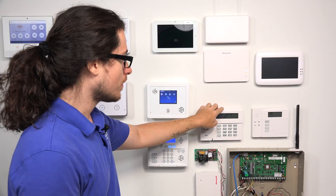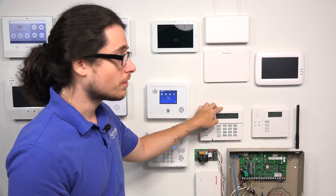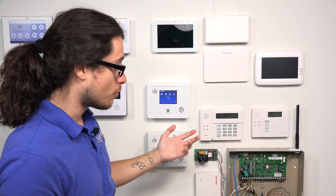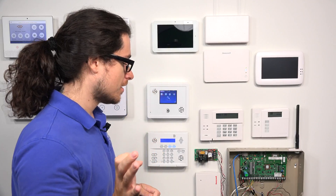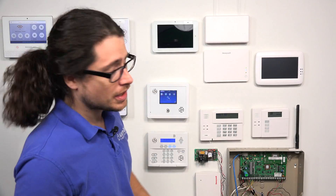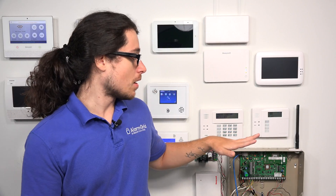Definitely check that out before you start the install — do a good mapping of the voltage you're going to be using, how much power these keypads will draw from the panel, and how much power the panel can actually support. If you do go over 600 milliamps, you can add an auxiliary power supply such as the AD12612. It's a power supply that connects to a 16-volt transformer — plug that into the wall and wire the keypad to the auxiliary power supply. That way it's not taking power from the Vista, but you still run the data wires to the Vista so it still works with the system.